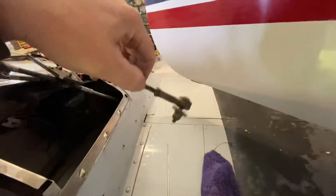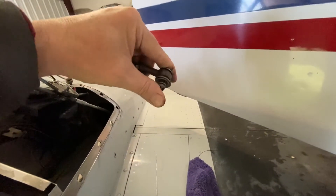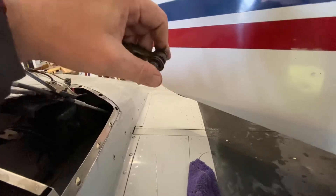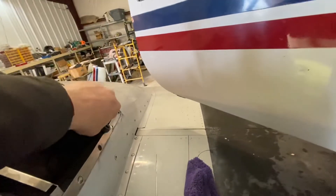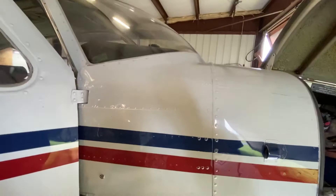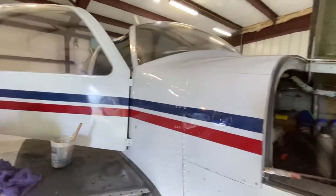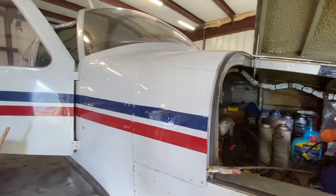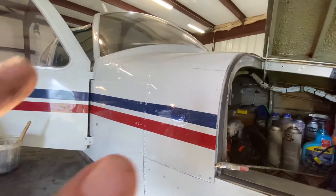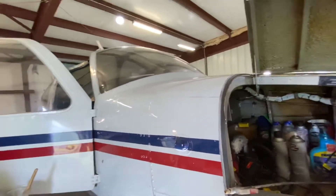What I've bought are the new ends. The bitter ends of the cables — the cables themselves are good, but all of these eyelets are shot. This one's very shot, won't move around. So I ordered a dozen new ones. We're going to change all of them since they're the same on both ends of the cables — same part number where it terminates on both ends. I'll start on the throttle quadrants and change the cable ends there first.